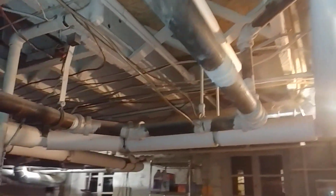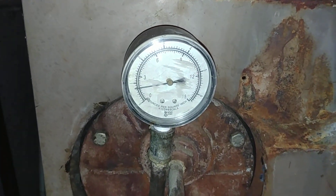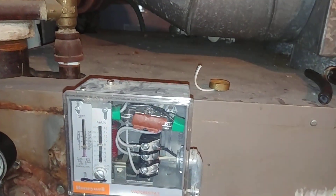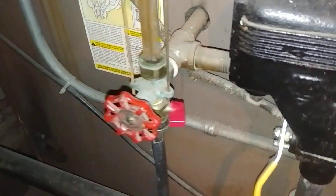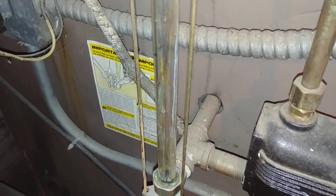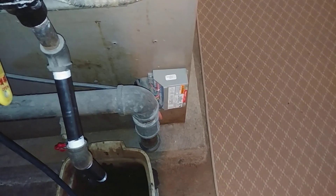We have hot water pipes attached to a really old American Standard steam boiler. The gauge reads in ounces per square inch and is showing about two ounces of pressure. There's a vapor stat installed on a brass pigtail, and the sight glass is bobbing up and down. Somebody has added a blowdown for the sight glass itself to test whether the sight glass is telling the truth, and we're getting a little bit of carryover on the top.